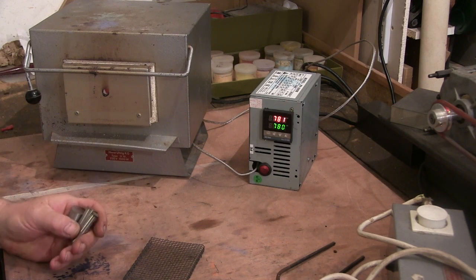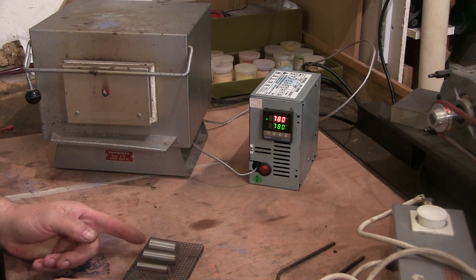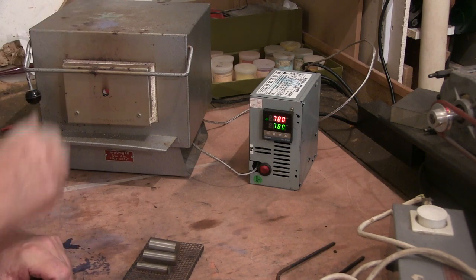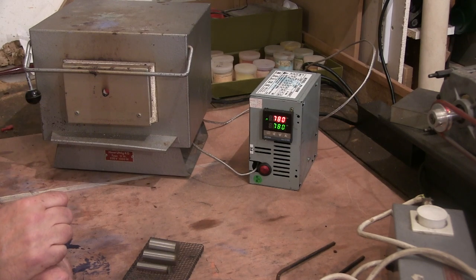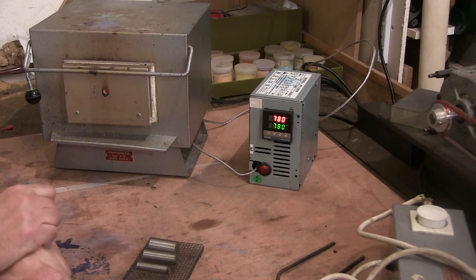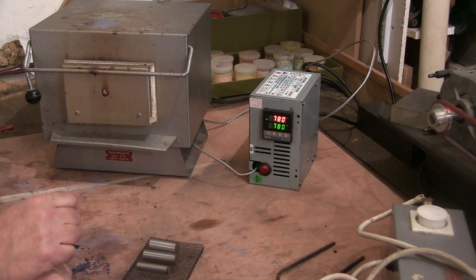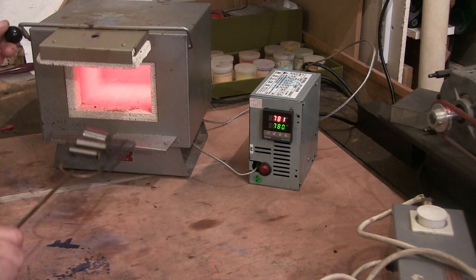But I'm going to try doing it in my kiln today. The kiln is up to temperature. I'm gonna put them on that little grid thing there and stick them in the kiln. When I get them out I'll put them on top before I quench them and try to get a photo of what colour they actually are. There's no natural light in this shed at all. I normally do them to a pretty bright red before they become non-magnetic, so it'll be interesting to see what colour they get to at 780 degrees. Right, I'm gonna stick them in the kiln. Oh it's hot in there.